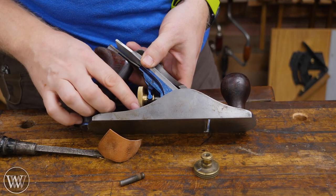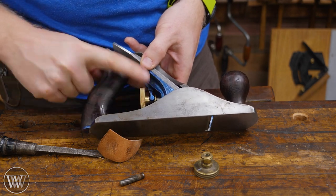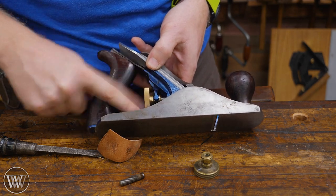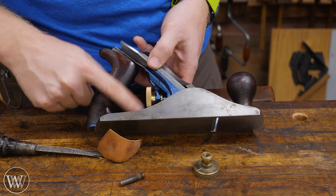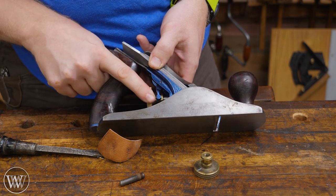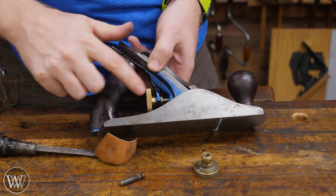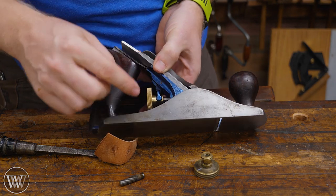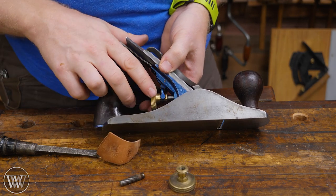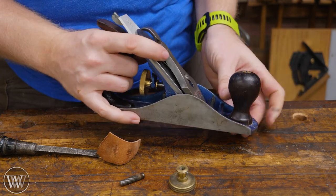Now this is going to feel really odd right off the bat as it's going to have a lot of movement. And if you have a lot of slop in this, you might have three or four full turns to get this all the way around. In this case, I have a little over four turns — about four and a half rotations to go from this connection to this connection. But once it's there, I've got a really nice, easy adjustment. A very little movement on this is almost no movement at all — it's a very, very fine adjustment. So when you're used to a 16th of a turn, you're going to need an eighth of a turn to do the same. So you do a 16th of a turn with this, it's going to do half the movement — far more adjustability.